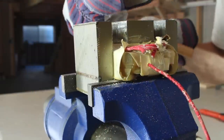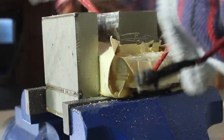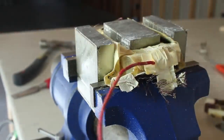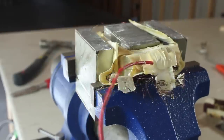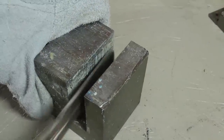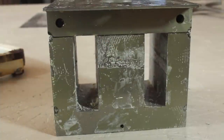These metal shunts can get knocked out now, and amazingly this is the only form of current limiting this transformer has. The middle coil is junk, and it all comes out. Then to get the secondary coil off, I'm setting it with the coil resting on the jaws of my vise and hitting the middle of the core with a rubber hammer until the winding is free. This got pretty beat up, but that's ok because luckily I don't need it. A chisel works great for scraping off any excess paper and glue stuck on the sides, and now we've got ourselves a naked transformer core.